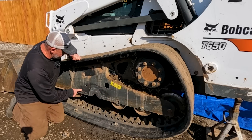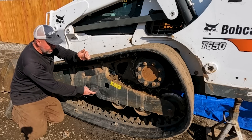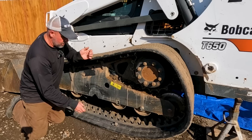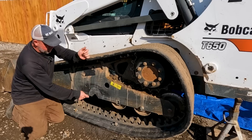All the rest of them look pretty good. There's no cracks in the frame. Usually what Bobcat says causes this is the bolts that go through the side of the idler actually get loose and that bogey kind of walks in there and starts to crack the frame.